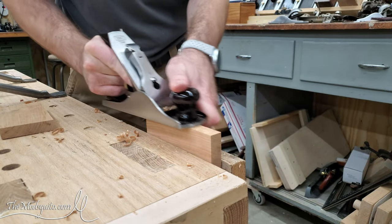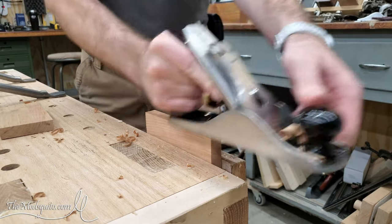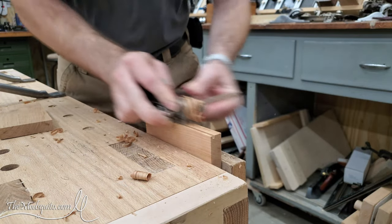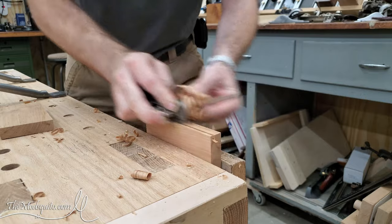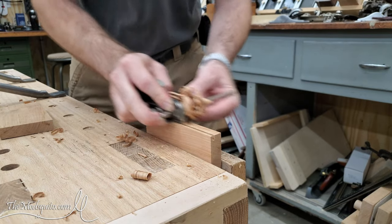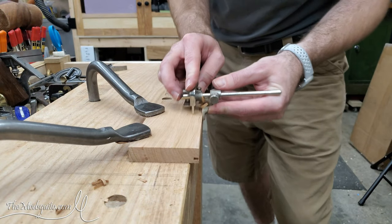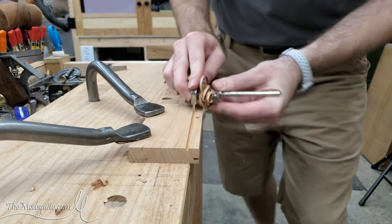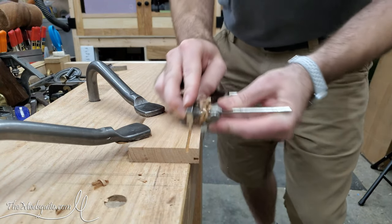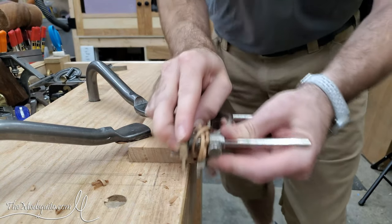The first thing I'm doing here is I've got just a hand plane and I'm cleaning up the edge of a cherry piece, and I'm using my Record mini plow plane to plow the groove that will eventually house the panels. You can see I'm cutting on the side that's further away from the fence of the plane, and the reason for that is that way when I flip the board and put it on the bench, I can use the exact same plane and plow the groove on the bigger piece before I cut off the little corner piece. That kind of allows me to keep the same plane setting for the whole thing, and I can just go through and make a bunch of these.